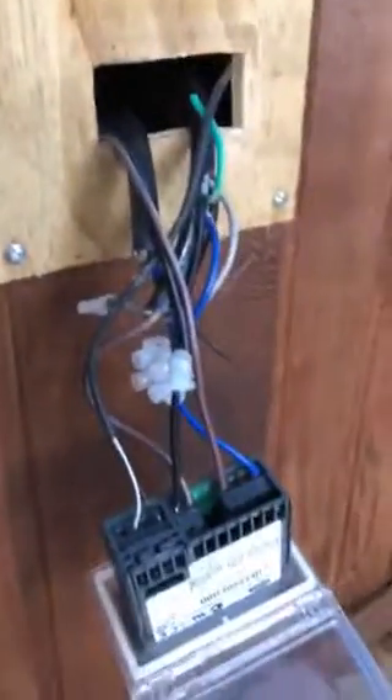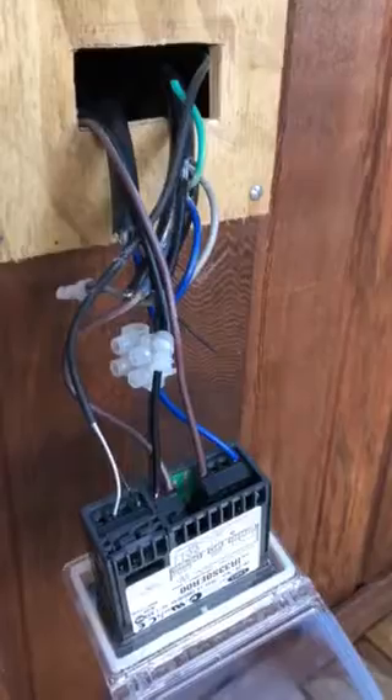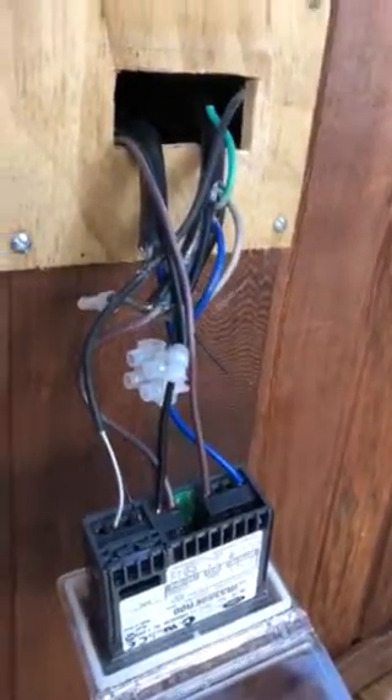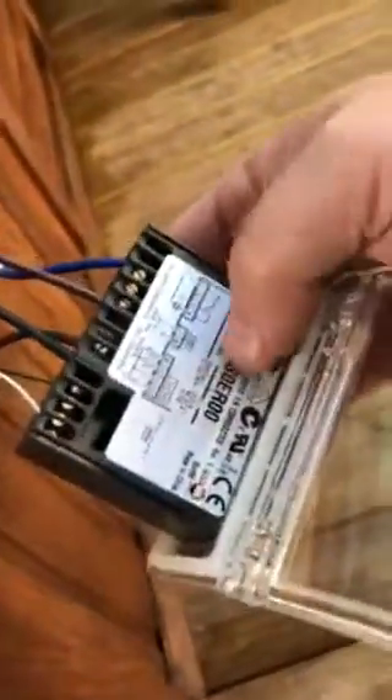This is the second one I've had to buy because it blew - I didn't have a heavy duty contactor. It's actually quite simple to understand how to wire it once you figure out how it works. It took me a while, thanks to my brother-in-law who gave me a hand. The contactor is the important part, because the reason this unit blew is there was too much current load going through the very small terminals and relay on this device.